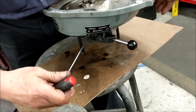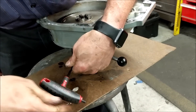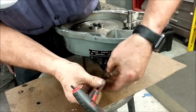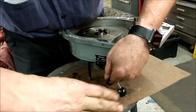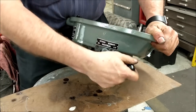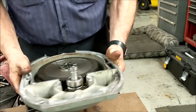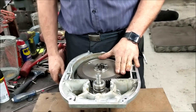Get started in the hole. You don't want to go super tight at first — get both of them started, let that drop down, and tighten it up. The part numbers will be on the video. At this point you have low, neutral, and high. You would put it back on your assembly, pack this with grease, put your covers on, and then your bull gear housing is done and ready to go. Thanks for watching, and don't forget to subscribe to our YouTube channel.